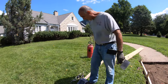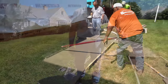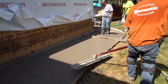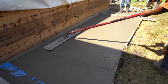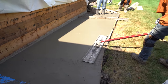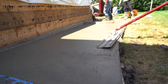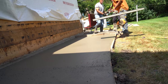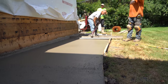And then your float, usually your float is what you pour your concrete, float it down, and we have a big one. It ain't out here because we don't need it, but we have a larger one, what they call a bull float, for bigger areas. The smaller one is your hand float, which you usually use when you go to finish it. But you can't actually get to all of it all the time. So if you're doing a large area like that, sidewalk and apron, we'll use a bull float to float all that down.